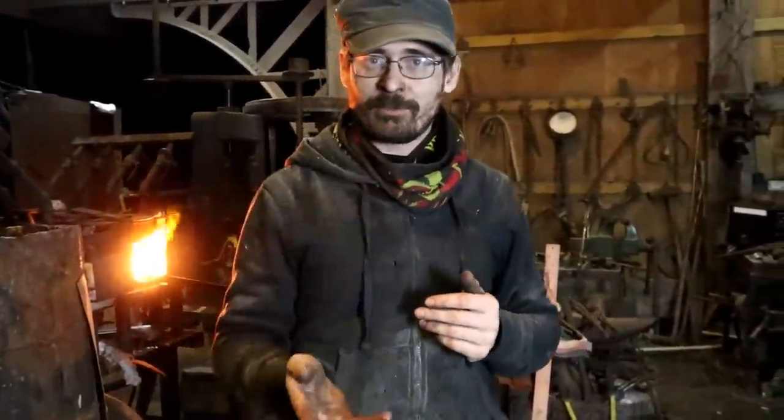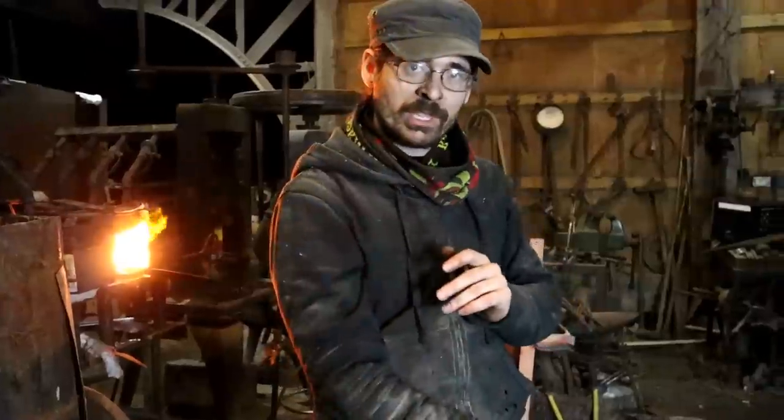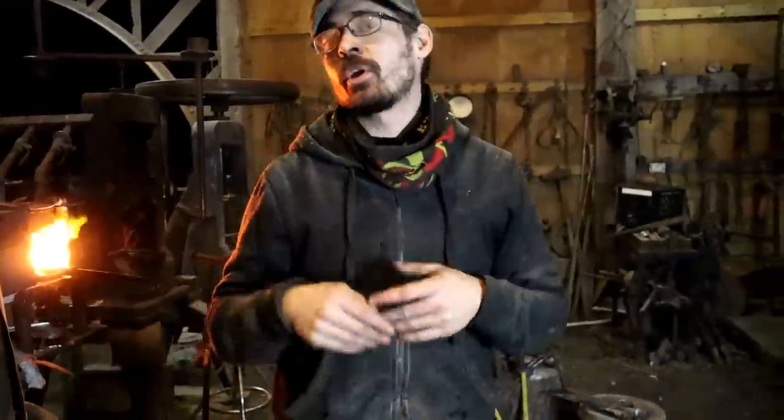Now, the key point about beveling these is to not pre-curve them or pinch them. The blade must be straight all throughout the beveling process. The way that is achieved is by compressing the material in on itself. You're almost pretending as if you're throwing the hammer through the anvil. That way all the forces are equal and your blade is straight in the beginning of the forging and in the end.